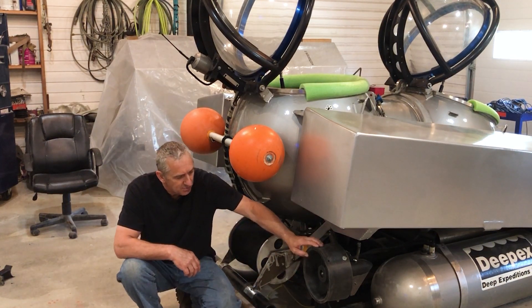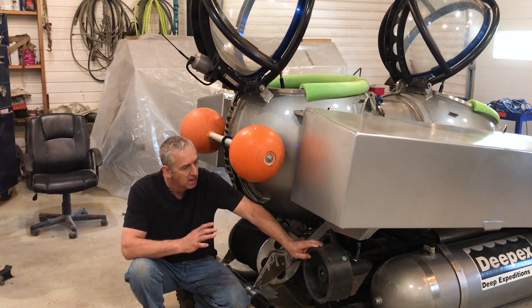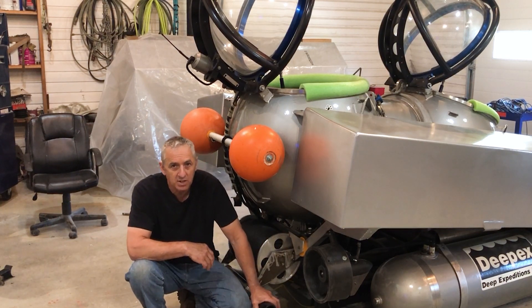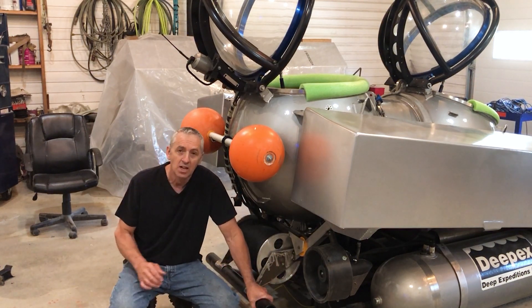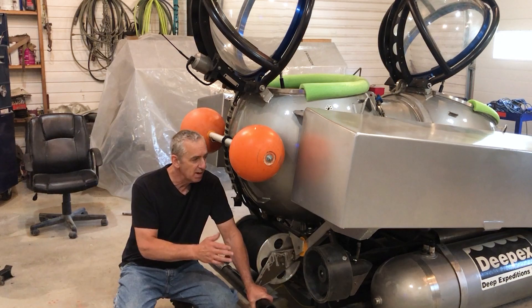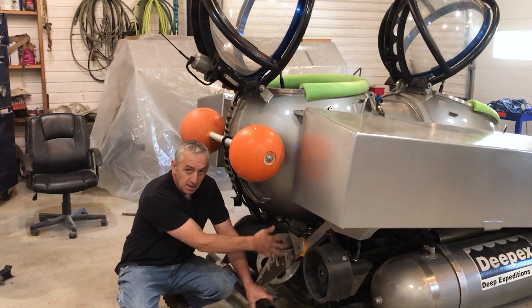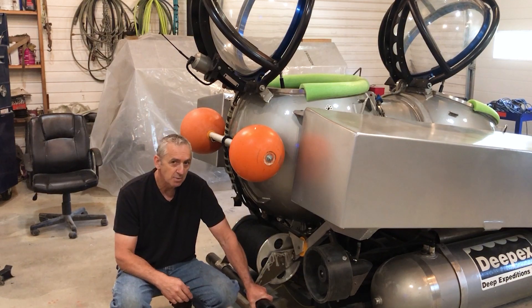You can see the aft thrusters are also mounted — they're not fully welded yet. I don't want to get too carried away welding this close to the hull; I don't want to damage any penetrators. So everything is just tacked together. Everything is mounted to the tanks and nothing is mounted to the occupant sphere, so when I remove this, the whole assembly comes with it. I'll take it off and weld it up outside — no chance of sparks and damage.